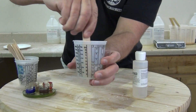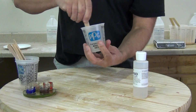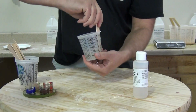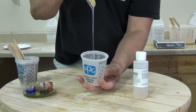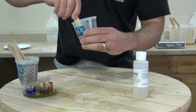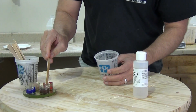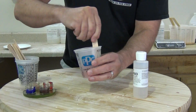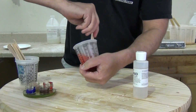5130 is a little higher viscosity than the 5110, but still very low viscosity as silicones go. For some of you making fairly simple, straightforward molds, you could get away with using this without vacuum degassing. Just like the 5110, the 5130 normal formula has a working time of about 25 to 30 minutes and a 4-hour demold. The fast version, 5130F, has about a 6 to 8-minute working time and a 1-hour demold. That 6 to 8-minute working time is long enough that you could easily vacuum degas it and still have plenty of application time.